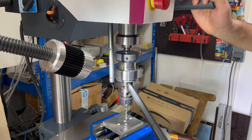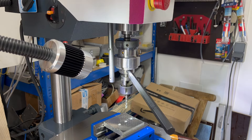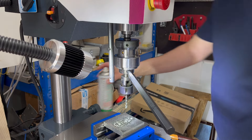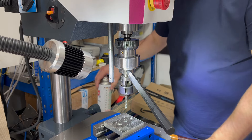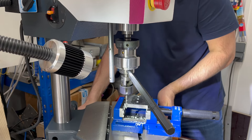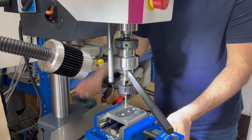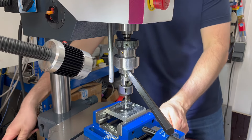I've used the stop here as a reference point for this thread-cutting adapter, because the length fits exactly. But of course this is only for my purposes and you don't have to do it this way. The holes I lubricated with Ballistol — the thread holes too, you should always lubricate them. Then I installed this in the higher position. And what is very important is that you always clamp the table.